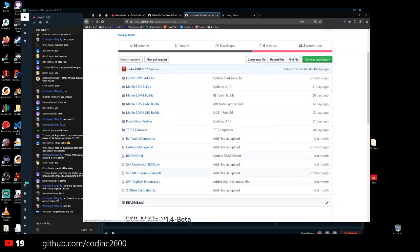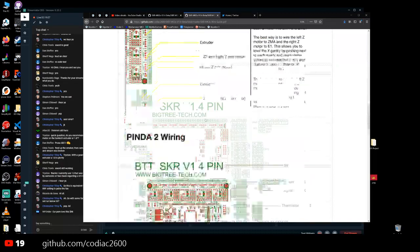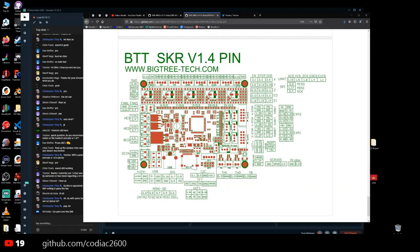And we'll go to this wiring guide, and we'll scroll all the way down to the last page. The wiring guide has 1, 2, 3, and 4 pins. So you've got fan 0, 1, 2, and 3. We can't use more than fan 0, because if you look at the fans, it says fan 0 is 12/24 and pin 2.3. Fan 1 is ground 12/24, so all that's telling you is that this 12/24 is whatever input voltage you have, it's only going to do that.